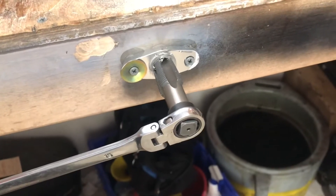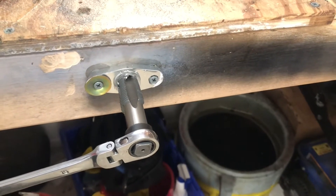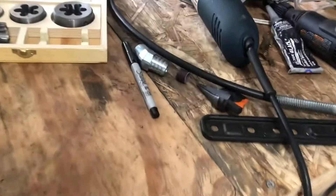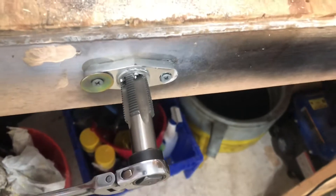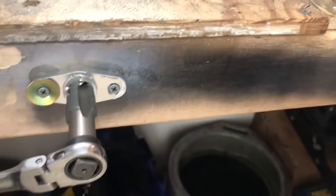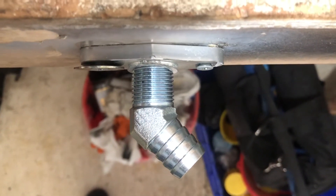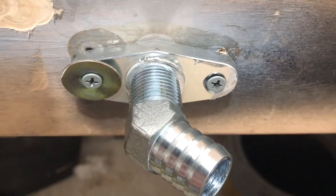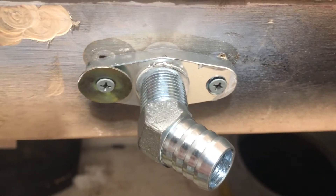I've got a 15-millimeter spline drive on this half-inch pipe thread tap. I'm going to go little by little and see how far I can get the 45-degree elbow in there, because it is a tapered tap — it'll stop and start to get tight. I want to make sure that when it does get tight, it's angled over to the side. I've only got a couple threads cut so far and it's nowhere close to where I need it. The tap's getting pretty tight in the hole, so I might need to drill it out.